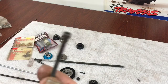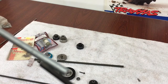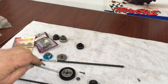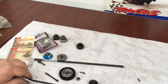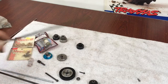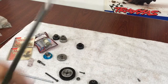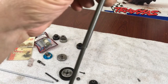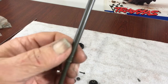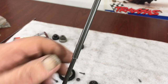If the crankshaft has a 4mm hole, the 3/16" tubing won't fit unless you drill it out — and you do have room to open it up. I'm hoping the V4 will be a 3mm like the rest of the engines. This here is a piece of quarter-inch brake tubing, and the 3/16" will slide right inside the quarter-inch, so if you need to make a spacer around your flywheel to take up space and provide support, you can do that.